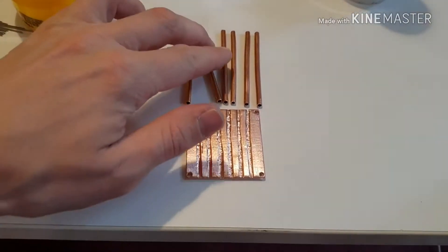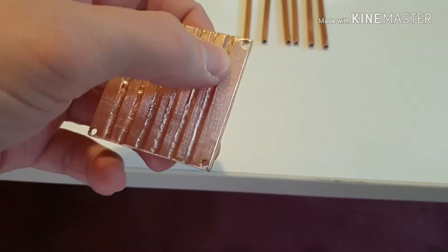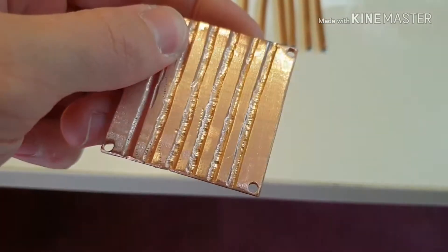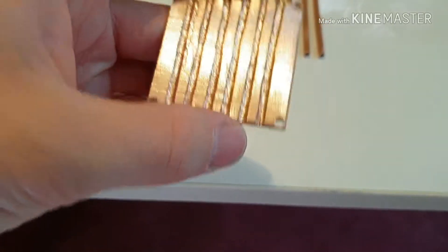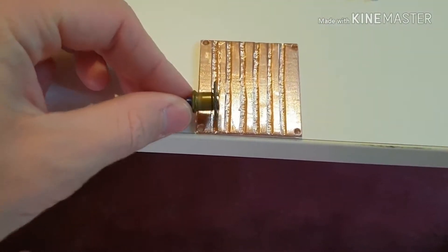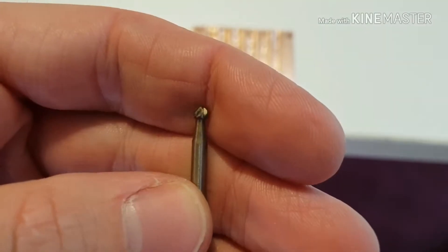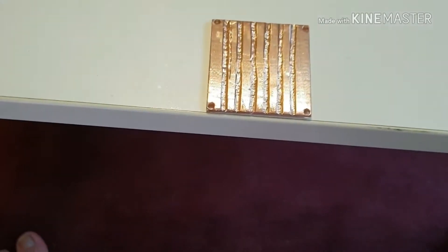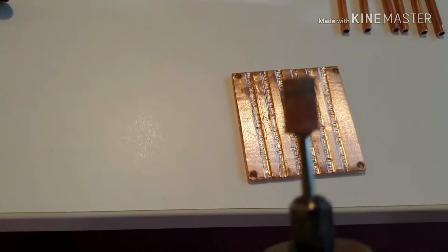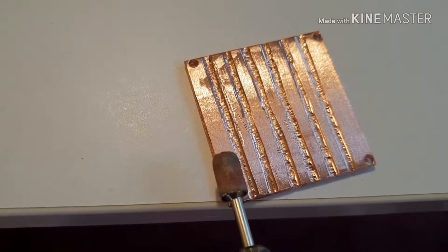This is the process of making one of these alternative heat exchangers. I've already shown you one of these copper plates — the beginnings of one. You can see here I've cut grooves for the copper pipes. These just increase the surface area in contact and give the solder somewhere to fill. I cut these using one of these Dremel cutoff wheels — a bit bigger than that to start with — to make vertical slices, to give something for the tool to follow. And then I continued with a ball nose cutter to make the beginnings of the grooves and hog out the bulk of the material. Then I went over again with a small diameter sanding bit, into the edge to the middle from each side.